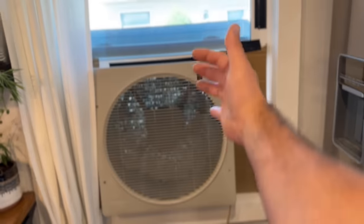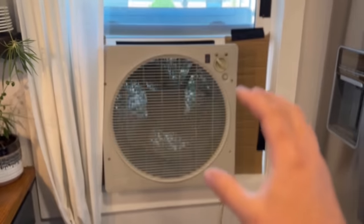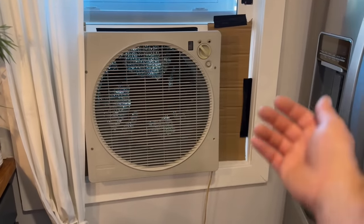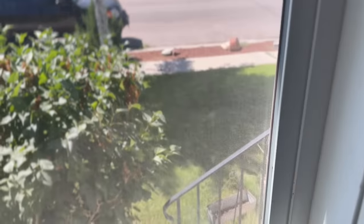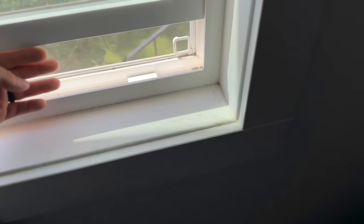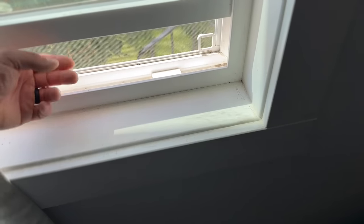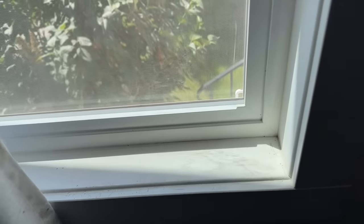The thing with the swamp cooler is it's pulling all of this air in, and that air has to go somewhere. So it's important that you open windows just a little bit in different areas of the home in order to get air moving to that part of the home. If the swamp cooler is all the way over there, you would simply crack a window about this much. You can actually feel the air right here being pushed out. You can adjust your windows depending on where you want the most airflow.